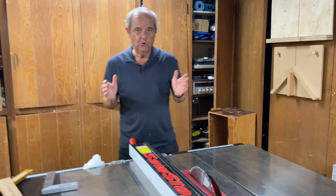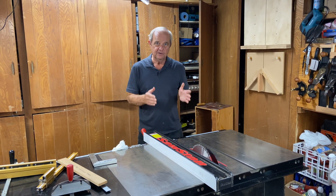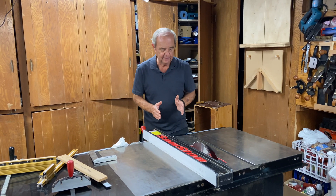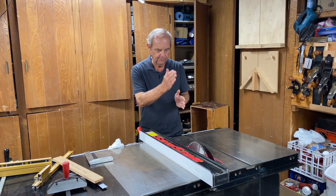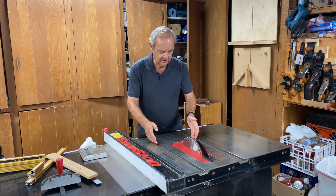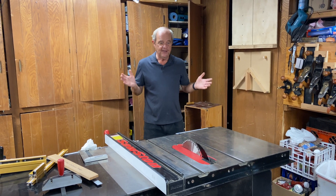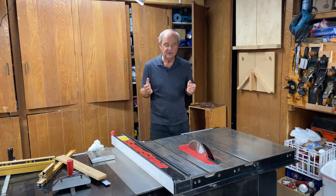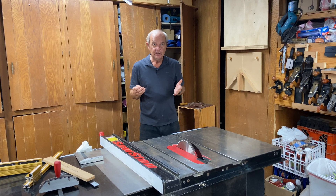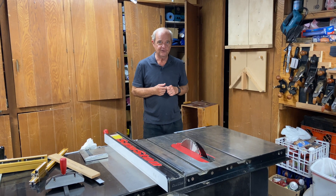It's very important in woodworking, especially fine woodworking, that you get things parallel and square. To cut straight on a table saw, you have to check and align it from time to time: align the blade to be perpendicular to the table, align the fence to be perpendicular to the tabletop, and align the miter grooves to be exactly the same distance from both the front and the back of the blade. Once you've done that alignment process, you should get quite a bit of usage out of your table saw making square and straight cuts before you have to redo it. If you like the content, please hit the like button and subscribe for future videos.